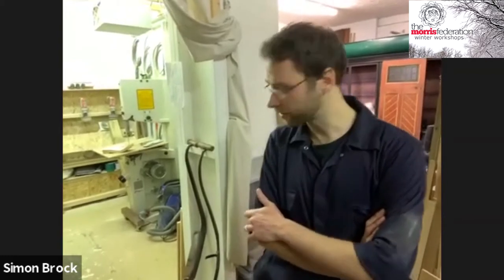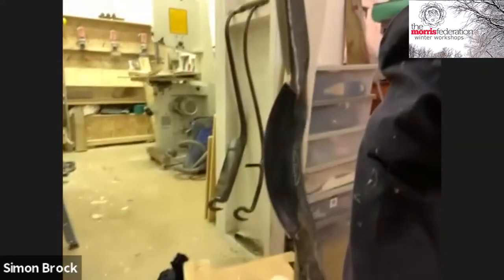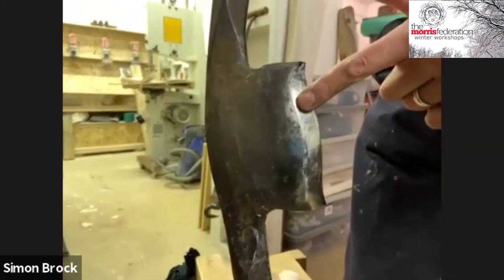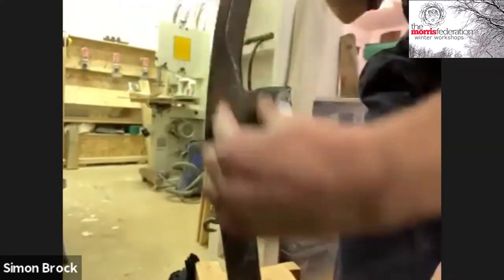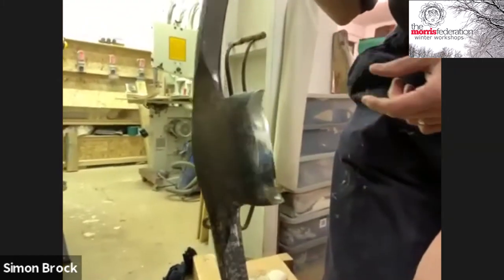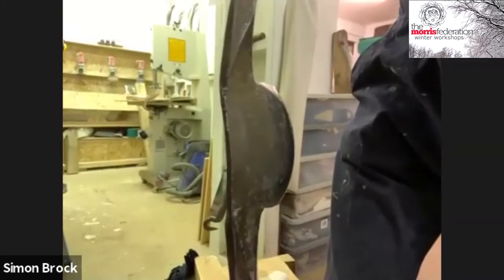They're not replaceable insofar as I did at one stage look into having some made and went to a few tool makers, and a couple of them were somewhat interested in making a blocker, but no one would go near the hollower. And I'm not a metallurgist, but my understanding is that the metal that the cutting edge is made from, can't believe it, I've just nearly cut myself there, has a very high melting point, and the metal that the handle is made from has a low melting point. And there's a very small window of opportunity where they're both at their melting points, where you can forge them together. So it's not just one piece of metal. This is one piece, and then the cutting edge is another piece that's forged onto it. Obviously, the curves are quite complicated as well. So there's a lot of complexity to them, more than most people would be interested in getting involved in as a little project.